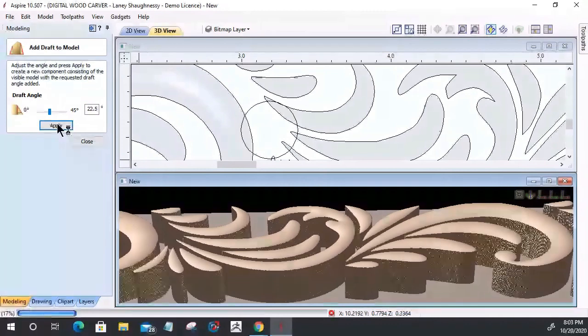While this is calculating, the raising and lowering when going from one pass to the next is your clearance gap above Z zero when it's moving from one place to another. As a general default, I have it set to 0.2 and 0.2. You can remove that, but I wouldn't have the bit dragging across the material to go from one line to the next. I would have it raise up a bit. Try it without it and see what it does for you.